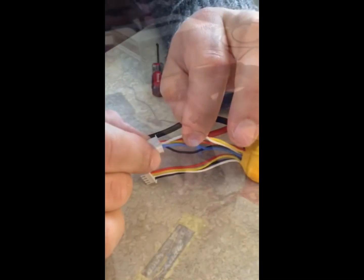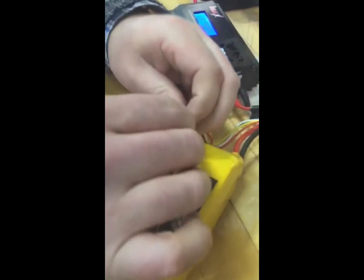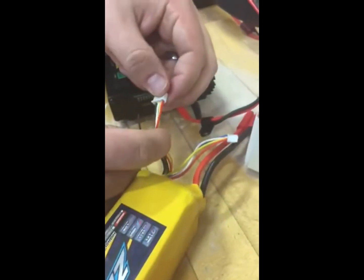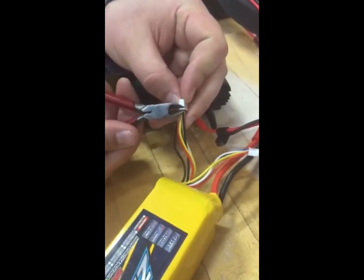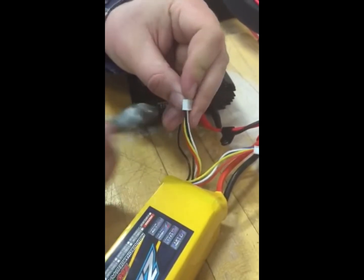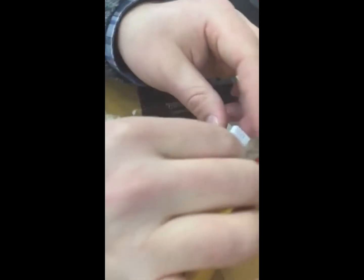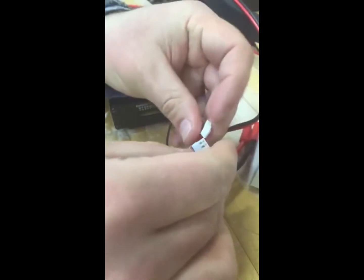Now when we show you at the battery charger it'll plug in really nice. I started clipping these little corners — on this battery it has little ledges. On the 3-cell connector, the one without the ground, I clipped one side and then the other corner so it fits in better. I do the same on the side with the blue one, because these connectors are going to end up butting together and that gives us some space.